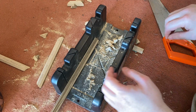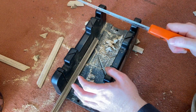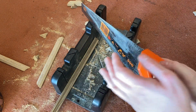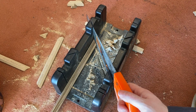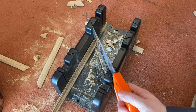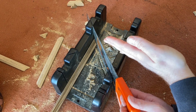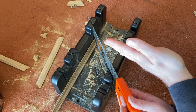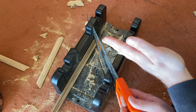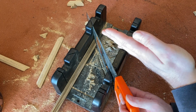Okay, so I've got a fresh bit of wood here and I've laid it in the opposite edge of the box. So let's get my wood saw. How shall I cut this? Now what happens if I do the same angle that I did on the previous bit of wood? Well, actually, you can see that the way that's going, again, we're going to get a corner like this. And this isn't the kind of corner we're doing. We're doing an outside edge corner. So if we cut this, it isn't going to meet the piece of wood that's already there.